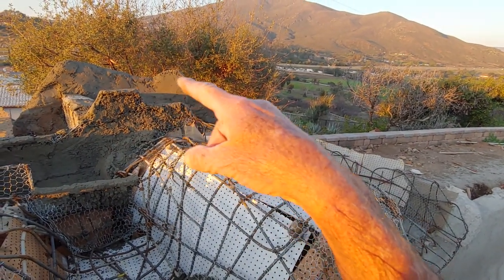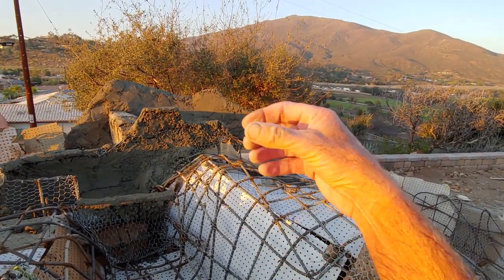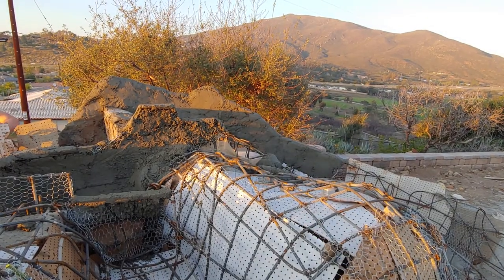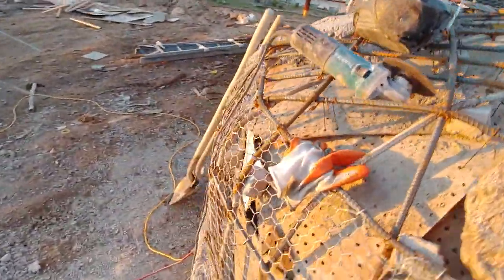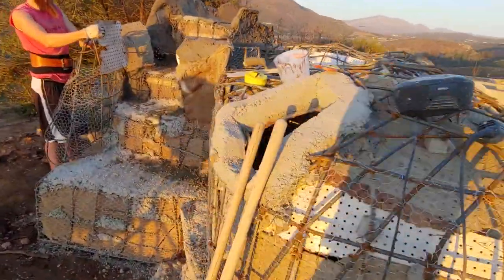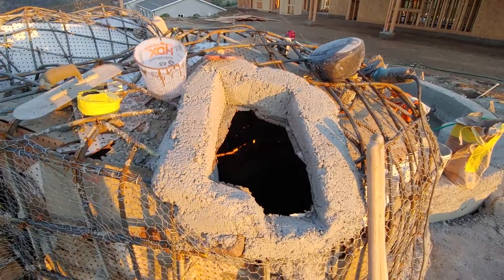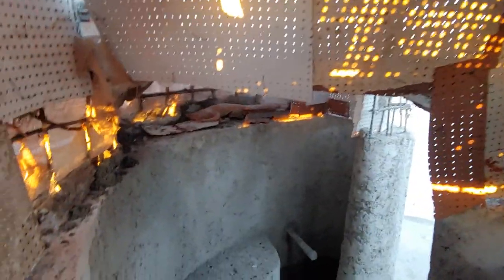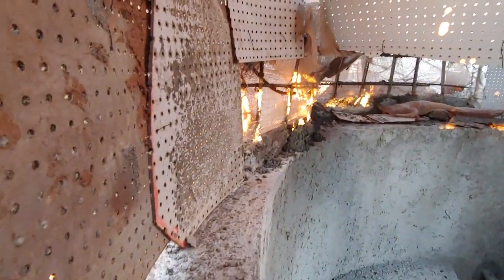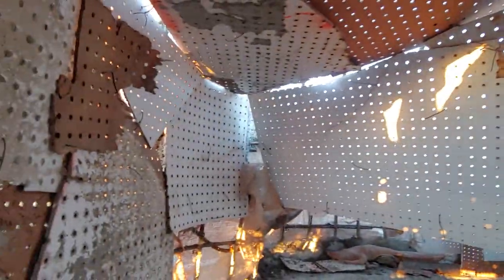The slide is looking good. We did the sidewall where it was just one thickness of rebar but two thicknesses of chicken wire on both sides. We just pinched mortar in the concrete mix - we have a concrete mix 4,000 PSI along with spec mix. We'll walk around and check that out. We got our window here, we pre-poured that already. You can see how that is - when they shotcrete, they just shoot it to the edge, the outer edge, inside, drop it down in. We got the same thing, pegboard prepped all around up above.